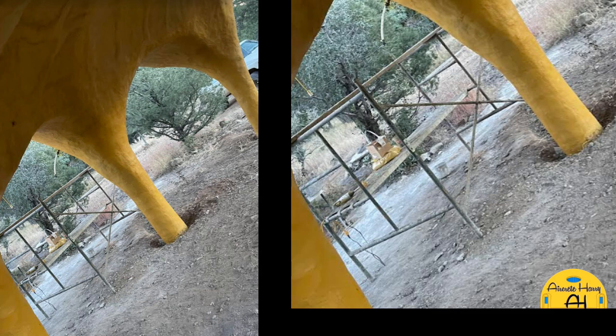Like if you're doing, say, a 10 to 11 foot span across your room, you can go with a small thickness and a small column height, in the 12-inch to 18-inch range. And if you go beyond that, around 16 feet, you're at 18-inch thickness for your stress skin roof.